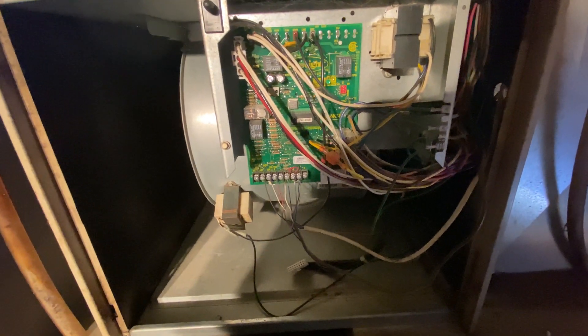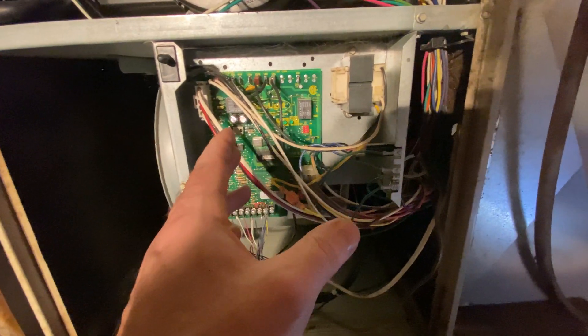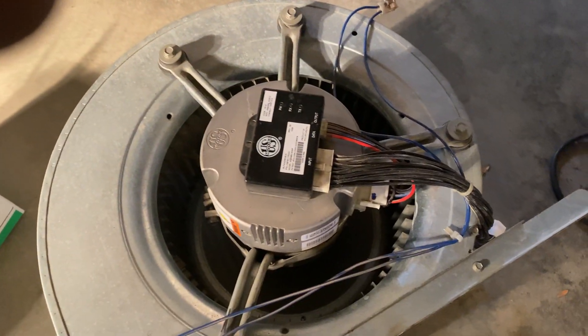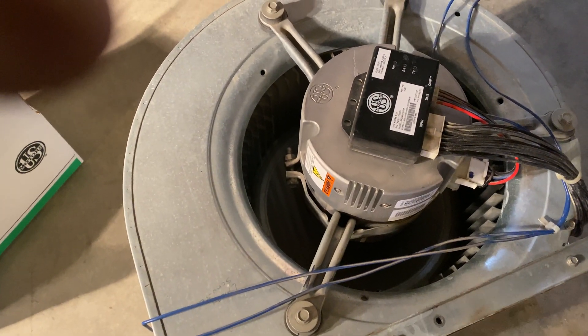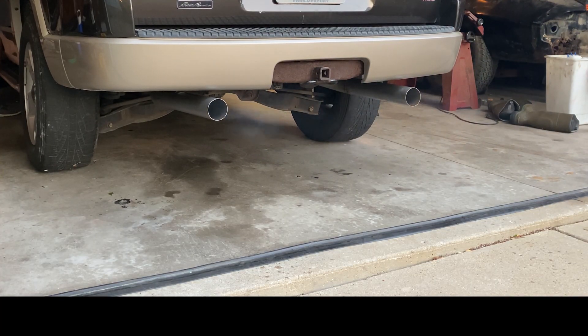Alright guys, I've already got the furnace doors off. I went ahead and unplugged the 16-pin connector; the other connectors are back on the motor itself. Really what I've got to do is just remove this box, put it out of the way, and then pull this whole squirrel cage out. Got the old motor out — that was pretty easy, maybe five to ten minutes. Just moved the control board off to the side. It's really just a couple of plugs, then undo these four bolts and there's another nut on the other side for the blower — the squirrel cage — and that should slide right out.